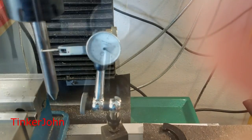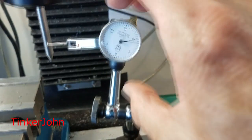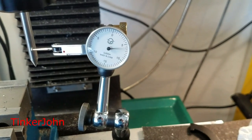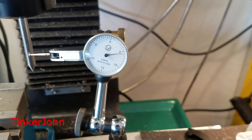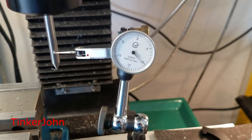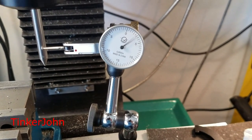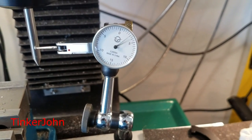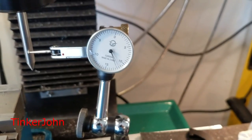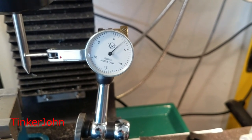Let's try another diameter and see. Now I'm using a quarter-inch piece, and I had the indicator upside down — I had it on the other one upside down also. That'll give you a little better idea. You can see how it's moving all over the board too. So I'm not going to check another one. I don't know what the problem is other than me and my luck with these Chinese collets, but I think they're just about one step away from the trash can.